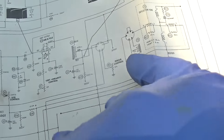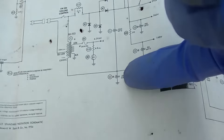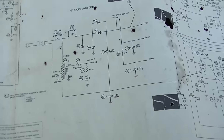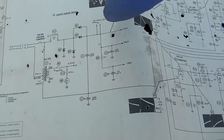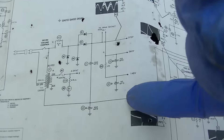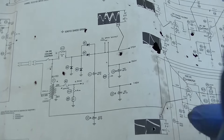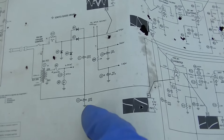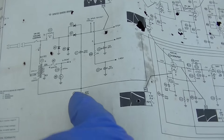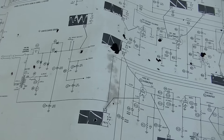The focus coil on the neck of the CRT is in parallel essentially with this capacitor, and it has a variable resistor there. What an interesting power supply — it's kind of like a hybrid between line-operated and hot chassis. I mean, it's definitely hot chassis. Line through transformer through 200 microfarad capacitor to ground is definitely a sizzle point.